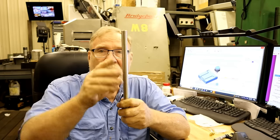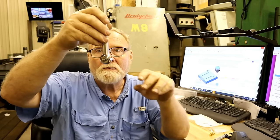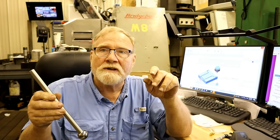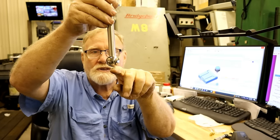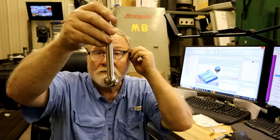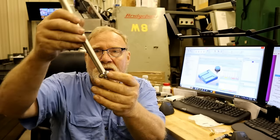This is the rod that this rides on different surfaces as you're measuring things. Now, I wanted this ball to be perfect on this rod. The only time it matters is if I'm measuring an inverted V way. Instead of on a V way, instead of this ball point touching, it's these two sides that'll touch. So I wanted it to be perfectly aligned with this shaft, so that as it's going down a V-rail, it's not going off like this, because this is cattywampus.